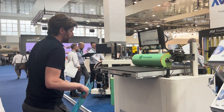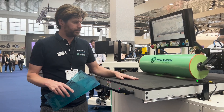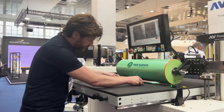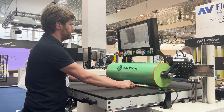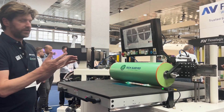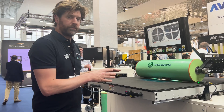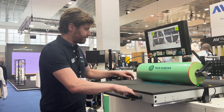How it works — I'll show you. The table of the machine is actually positioning the plate automatically. The machine uses image recognition to recognize the mounting marks, so I will put the plate upside down in the field of view of the cameras. You can see it on the screen. Then we hear the vacuum system coming on, and you can see that the machine is automatically positioning the plate. The accuracy is performed by the machine, not the operator — mounting with 5-micron precision, time and time again.